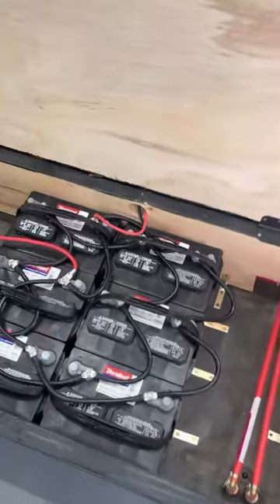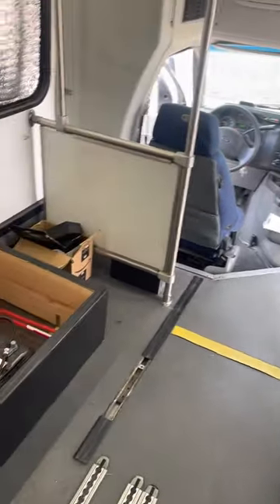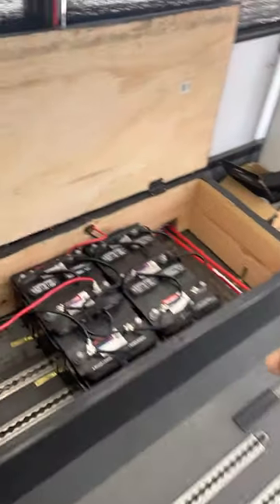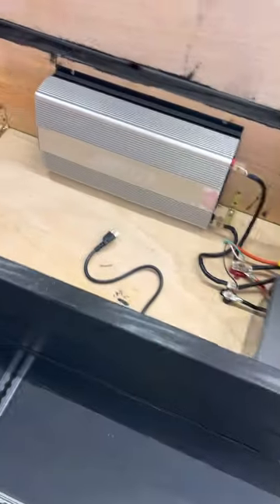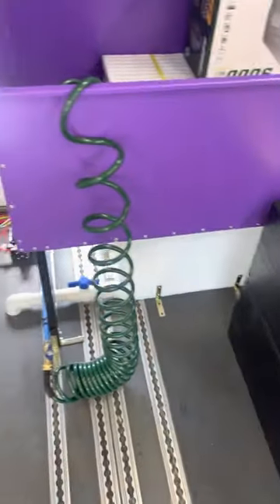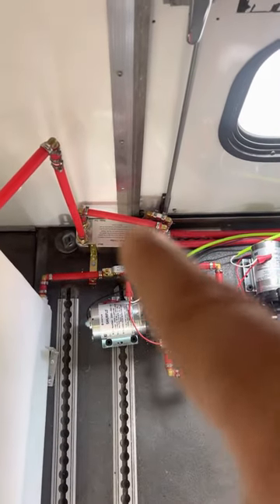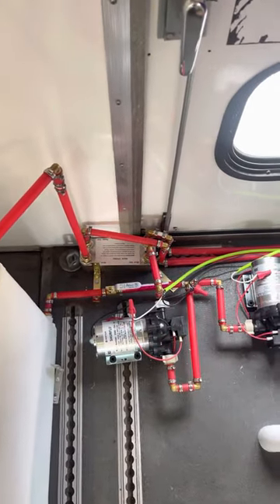When you come in the morning, fill the water tank, turn on your engine — the engine has to be running so the water gets hot — then you do the heat exchange. You turn on the pump and it starts operating. The water from the engine will heat the heat exchanger through the plates.